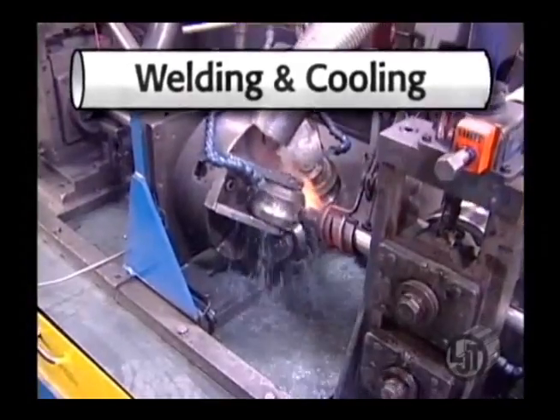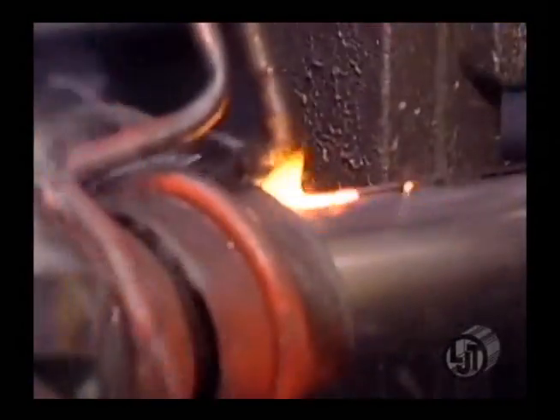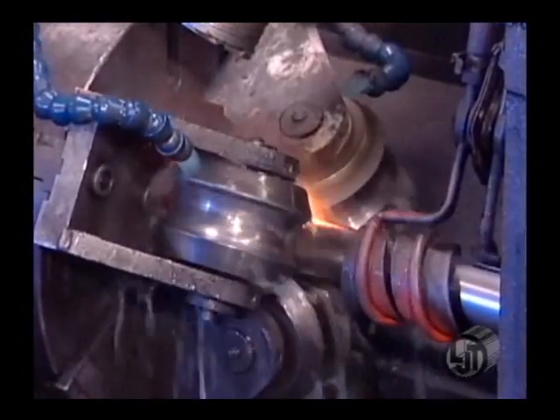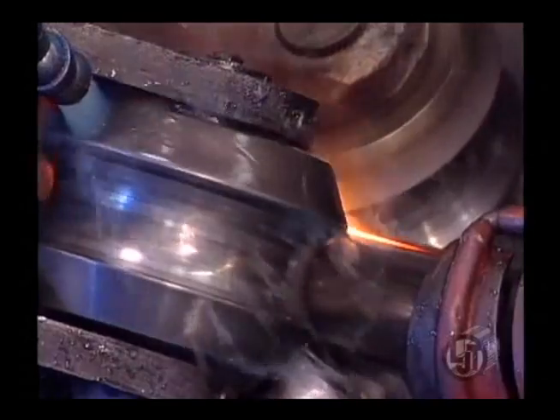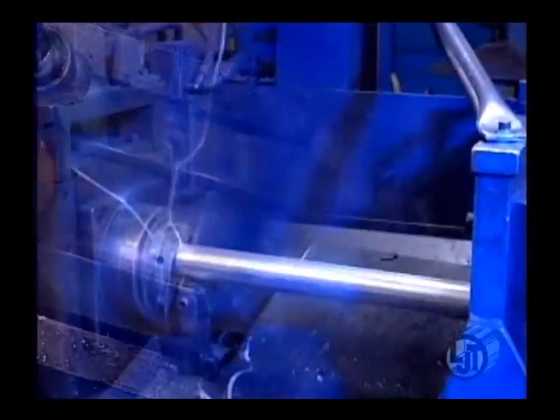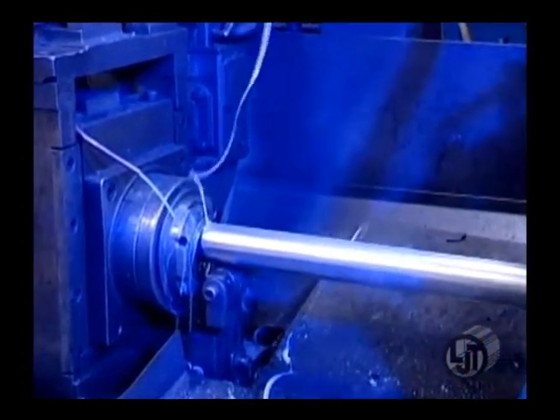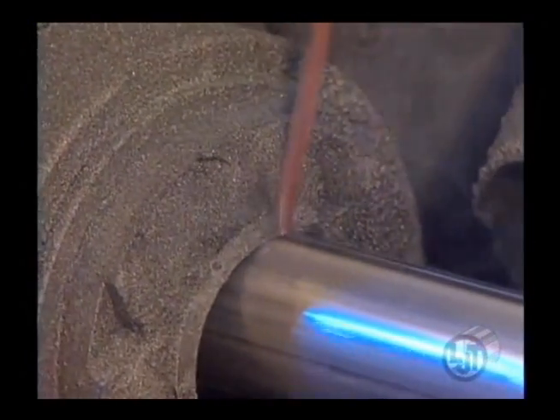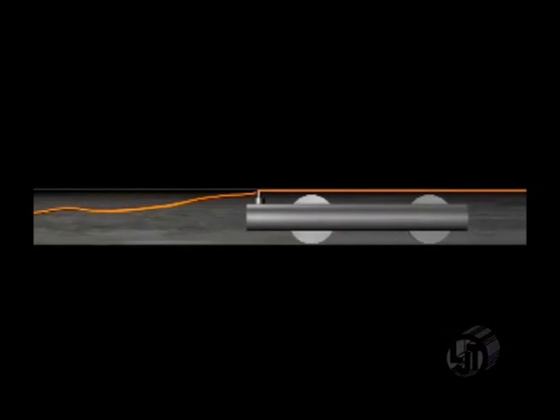The round shape is then welded with a high frequency induction welder. Three rolls in the weld box generate forging pressure on the strip edges, creating a structurally strong bond. A rotary scarfing unit removes the OD flash, leaving the tube smooth to touch. A flash rod assembly rolls or removes the ID flash as necessary.